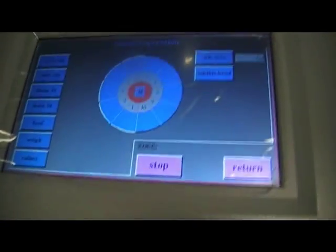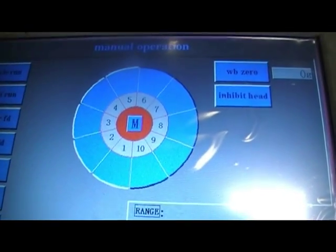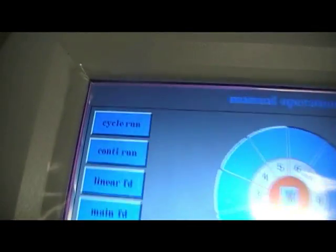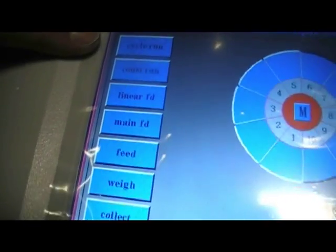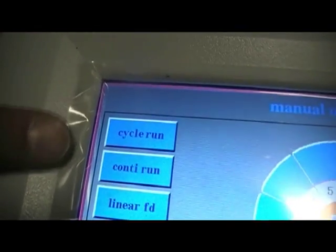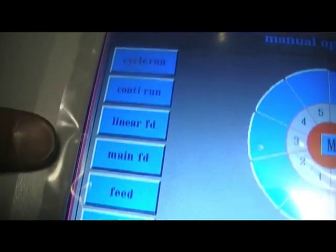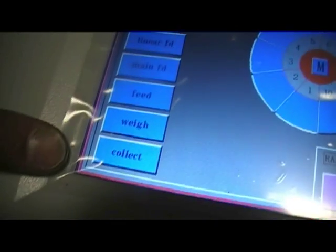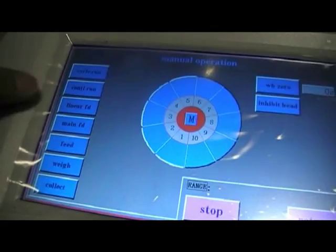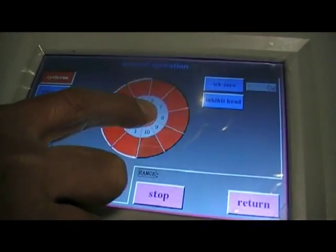Again, we get an overview of the equipment with the numbers of heads, and down this side we've got various functions on which we can manually operate. We can run a cycle just once, we can run continuously, we can run the linear feeders, the main feeder, we can also use the feed, the weight and the collect buckets, and we can basically select whichever one we would like to do. So for a cycle run, we select cycle run and press the key in the middle,